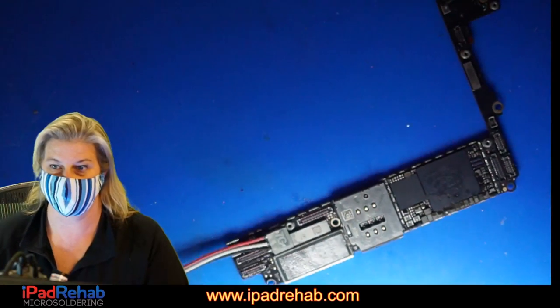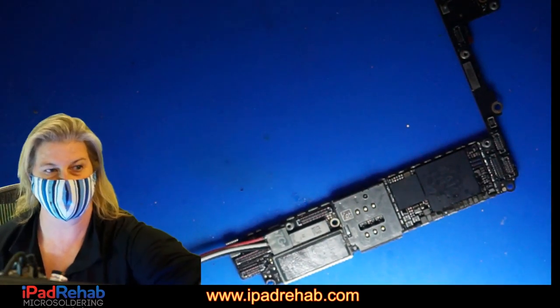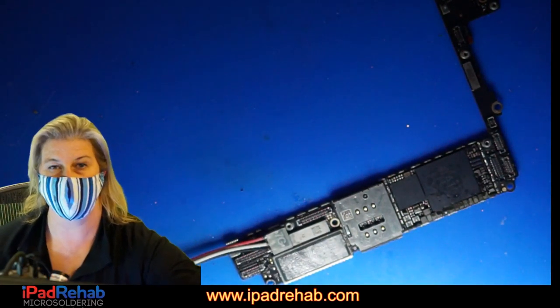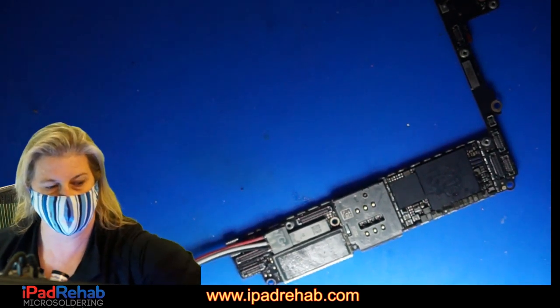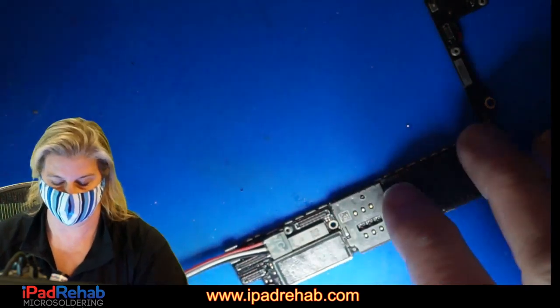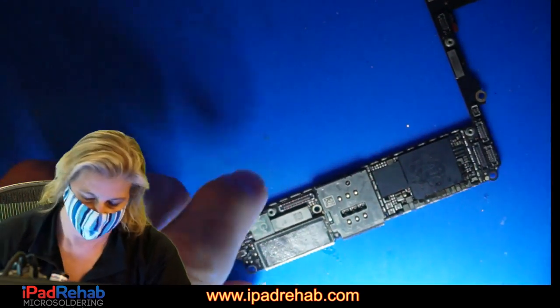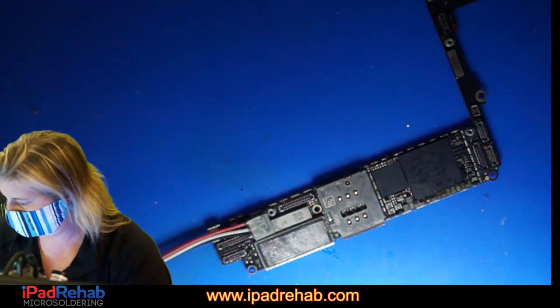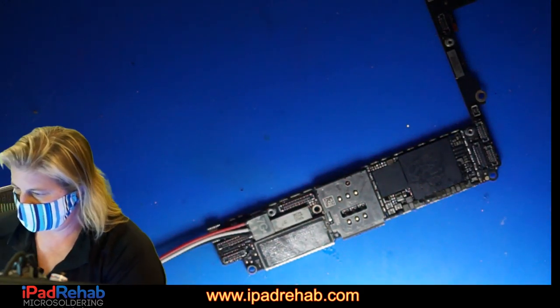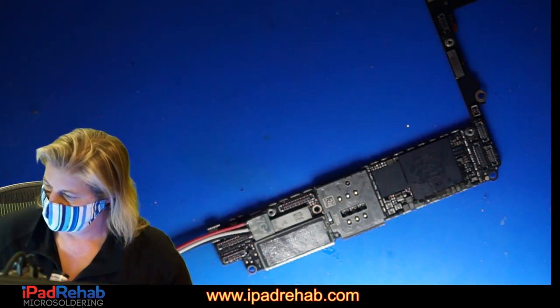All right. Attached battery power and I see 200 milliamp current leak. We have a leak. It's leaking. There's a 200 milliamp current leak. So I'm going to disconnect up there at the DC power supply. That means we have an inappropriate path to ground somewhere, and we've got to find out where.